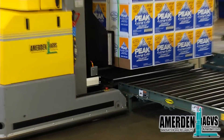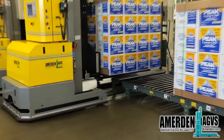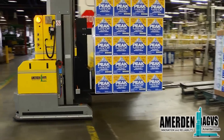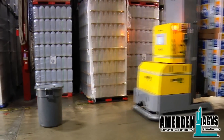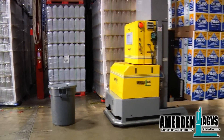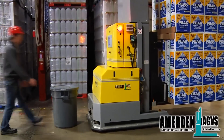After being stacked, the AGV brings the box loads out to the warehouse. Should an object be in the path of the AGV, the front laser bumper will detect it and stop the AGV. The size of the laser bumper field dynamically increases the faster the AGV travels.